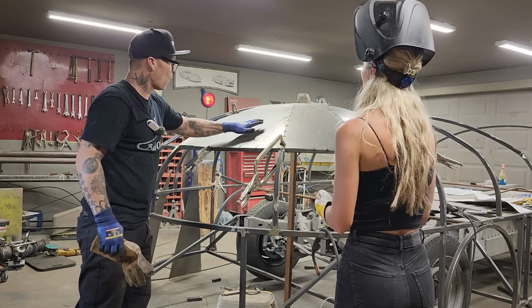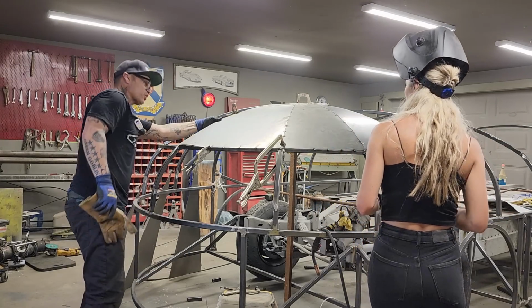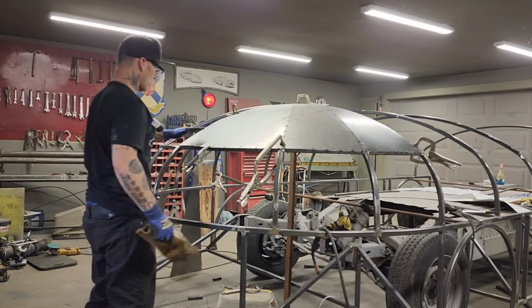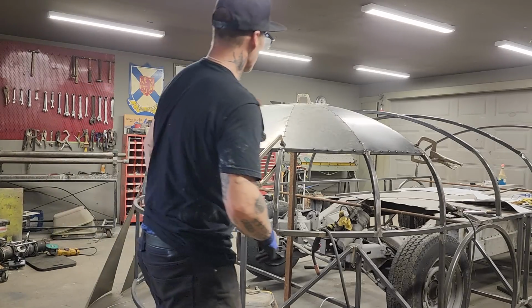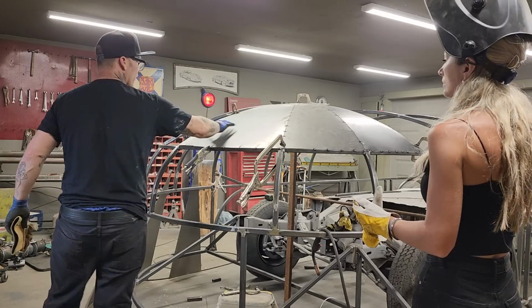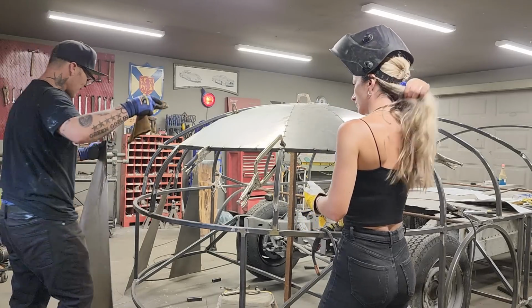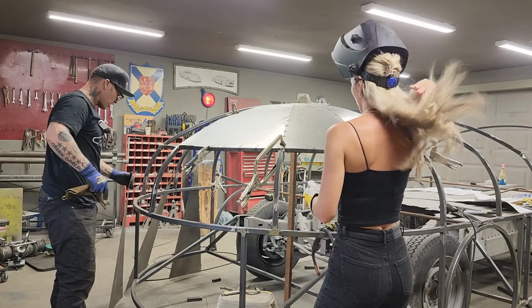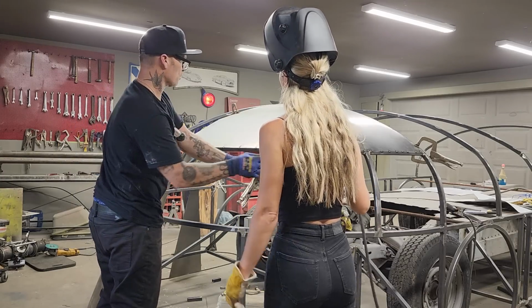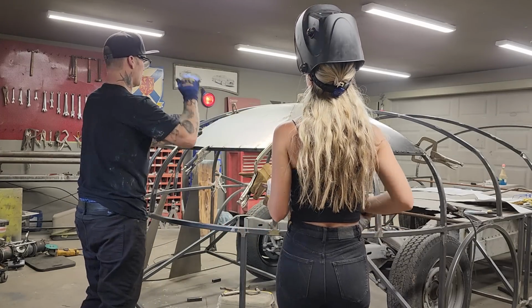Did not want to do it before I applied the piece because I did not know what shape it should be or how much it should come up. But there is a little bit there that I probably would enjoy to come up, so we will probably put something in there. And that's just a matter of applying it. This over here looks really good. These ones are smaller. This is the bigger, flatter area. We put lots of shape in it, but to bang that and try to roll that on the English wheel and try to find that shape, I'm not going there. I'd rather just go in there and put a nice brace going across, put a little shape in square stock, weld it in and be done with it.